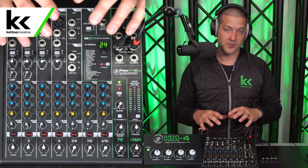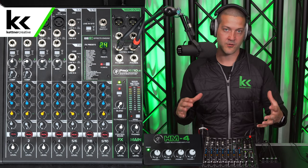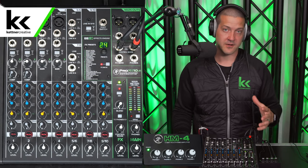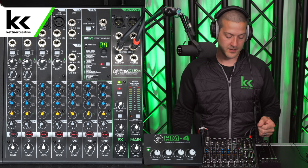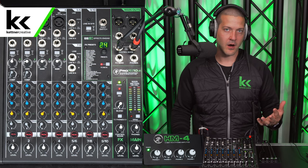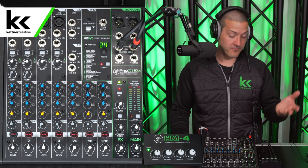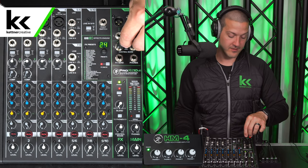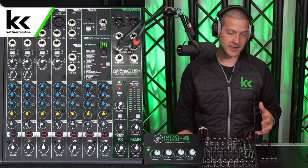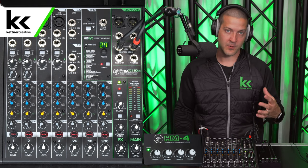This works really well. On some audio mixers it's actually better to come out this way because you get more features when using desk monitor outputs — there are sometimes buttons or modes for soft patching or hard patching to better control the mix for your headphones. On this audio mixer I have a separate volume control for this output, though that's not always the case. If you want to split a signal eight ways, you can use this output to one headphone splitter and the headphone jack output to another. In terms of quality, I find this just about as good as the headphone output from method one.